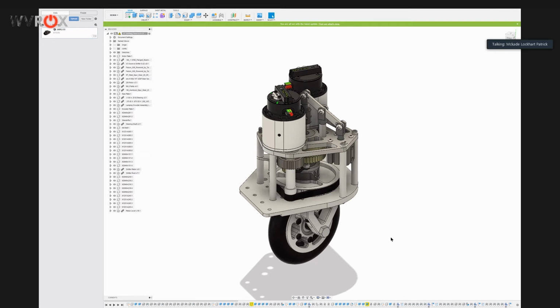Another thing I'm interested in this year: with a tank drive, you lose a lot of speed whenever you're turning and making adjustments. I'm curious how having a really high geared robot is going to work with the Swerve, because you're always maintaining your momentum and never really changing direction. You're going to have a lot more time to accelerate instead of always turning, when shifting between a really low and a really high gearing. So those are the advantages we hope to have.